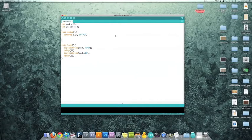We'll also have to add a new parameter so that the sketch knows that pin number 9, or whatever pin you chose for yellow, is also going to be used for output. If you forget to put this in, the yellow LED will not blink as bright, or just not blink at all. Next, we must tell the yellow LED to do something. To fully illustrate this example, we'll have the 2 LED lights alternate blinks, so that while one is on, the other is off, and so on.